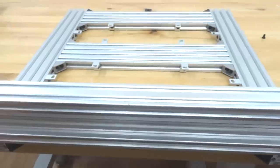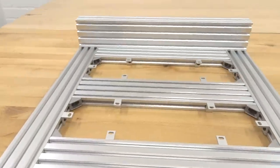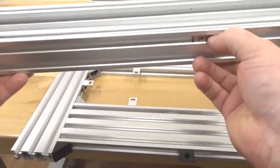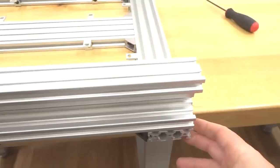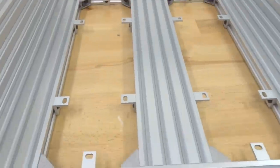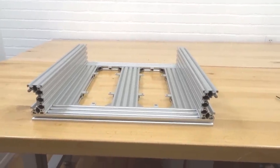Once you have that tight, gently turn the machine to the opposite side. Once again, hang it over slightly so we can access the bottom of our C-beam. Align our T-nut so it's easier to mount to our black angle corner connector, making sure the C-beam is aligned to our base assembly. Mount that into place. Now that we've got this nice and tight, our assembly thus far is looking great. Let's go ahead and move on to our next step.